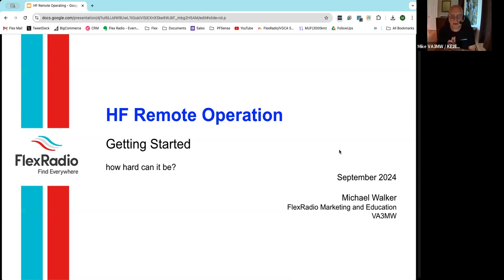Remote HF operation is not so brand new, maybe more in the UK, but I have been doing it since 2005. A bit of history with me: I live in the city of Toronto. I operate HF, and I noticed that the urban noise kept rising and rising. Actually, I really noticed it even started to rise at VHF frequencies. I'm fortunate that my XYL has a summer house or a cottage. You call them different things in different parts of the world. We call it a cottage. My friends not far north of here call it a camp, and I'm not sure what you call it in the UK, but it's blessed with internet and a really quiet noise floor. The difference is almost 25 dB on the noise floor, and that's the difference between being able to hear something and not being able to hear something.